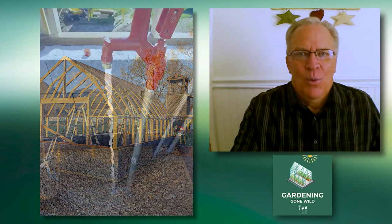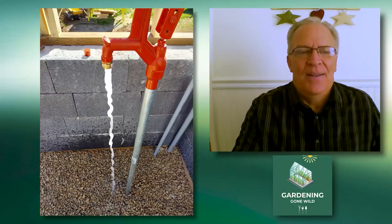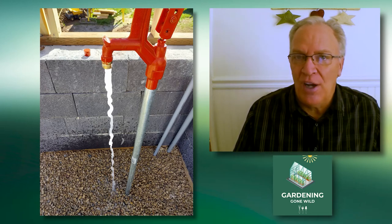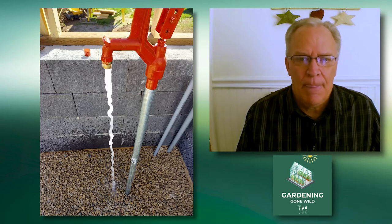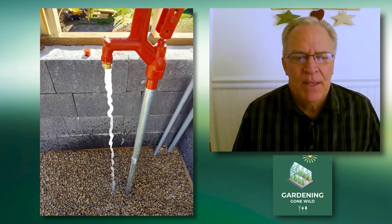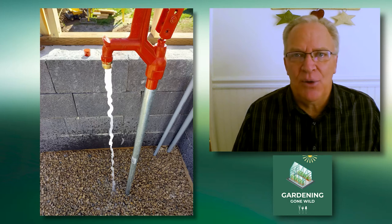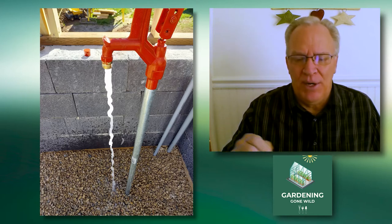There's our roof all put together at sunset looking pretty spiffy, and another angle from the west looking east — you can see the beautiful mountains in the top right-hand corner. We continue to add to the structure to make sure it's good and solid so when we wrap our polyethylene on it, it's strong and sturdy. One of the awesome moments was when we turned on the frost-free hydrant and we had water. If you plan on doing things in the winter in your greenhouse, you definitely want a frost-free hydrant if you're in a cold climate like Utah — otherwise your pipes are going to freeze and crack. That farm hydrant was about $150 from my local sprinkler supply company, and my pipe goes about three feet into the ground so the water drains back down when I shut it off.